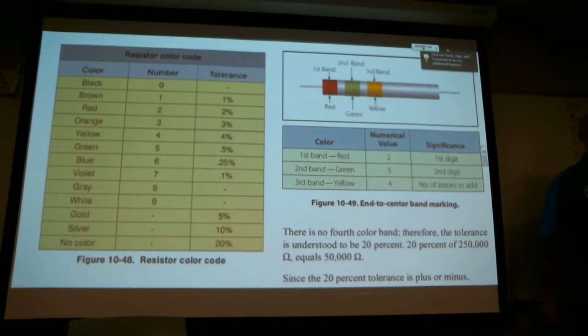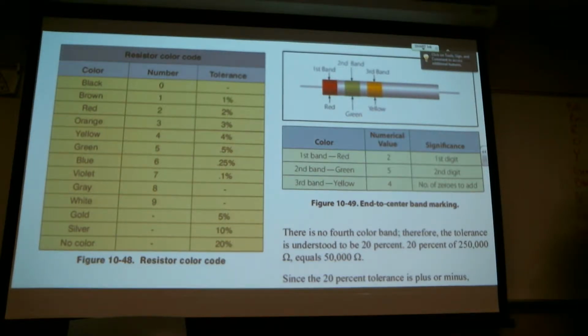Shops can be great. The slide shop was one of the most cush jobs. The slide shop handled the door slides, and these guys would go out to the airplane, blow the slide and watch it deploy. Then the mechanics would help drag it into the slide shop. They do a full inspection, do a test to make sure it holds pressure for a certain period of time, and then repack it, routine time scheduled maintenance on the slides. But it was carpeted in there because the slides had to sit on the ground. It was air conditioned. They had a radio. It was a sweet job.